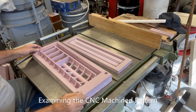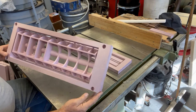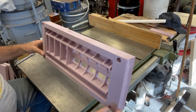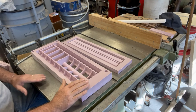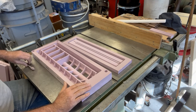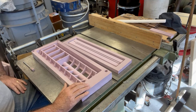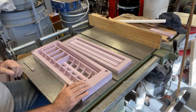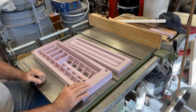This is where it all starts for the casting for the z-carriage — the traveling part of it. You can see it spent some time on the CNC router; it's still in the machining frame. I actually had to make the lost foam pattern in two pieces, for two reasons. One, I can't get foam stock easily that's thicker than two inches, and the z-casting is about three inches thick. Not very many glues that are decent lost foam glues machine very well — they load up the cutters.